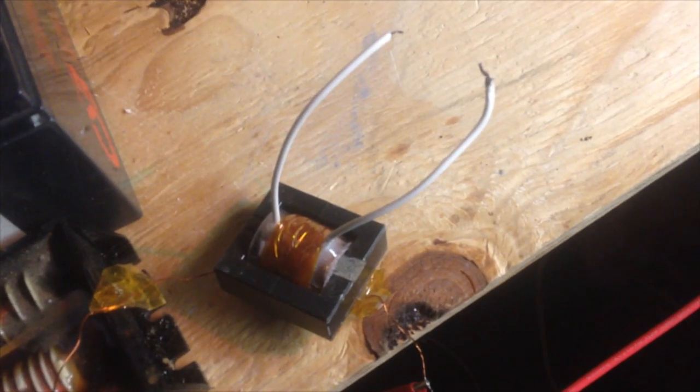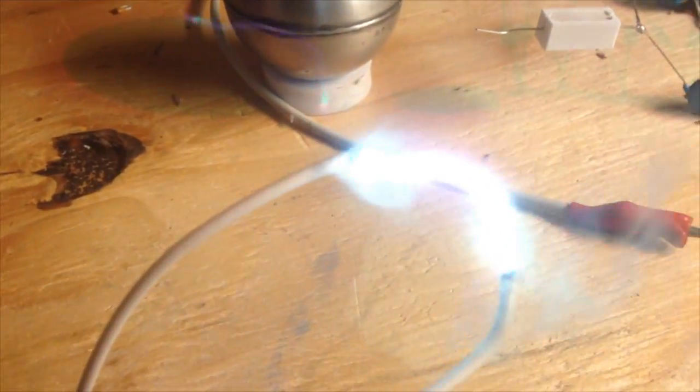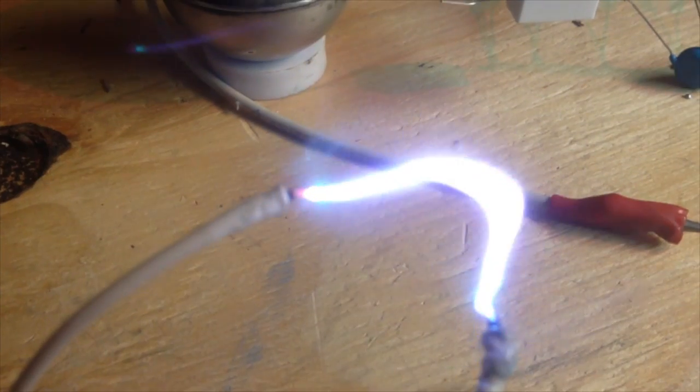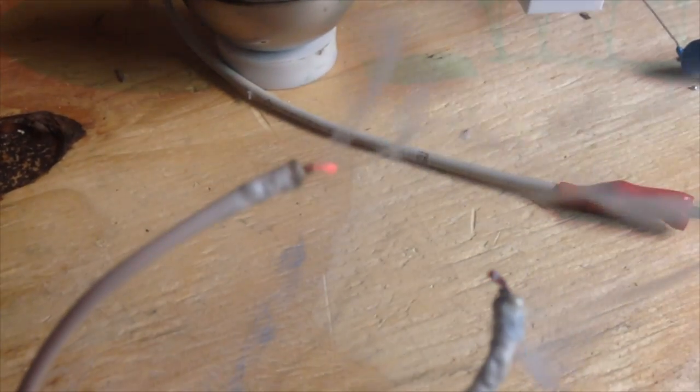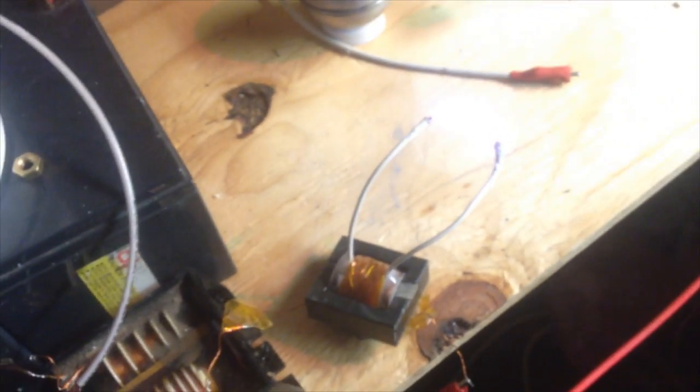Now back to the archives. Since the Tesla coil driver was already set up on the bench, I decided to connect it to my ion engine power transformer and the results were amazing. The ion engine only needs about 60,000 volts to run, which can easily be achieved with a voltage doubler connected to this transformer. Here we can see it easily jumping a 25,000 volt gap. I've tested it all the way up to 40,000 volts when completely immersed in oil, and it's incredible to see such huge sparks from a tiny 40 millimeter transformer. When running in open atmosphere, the maximum output voltage is limited by corona that forms around the core due to intense voltage pressure from nearby windings. Look here and you can see the glowing purple corona that leaps toward the core moments before the arc is fully established.